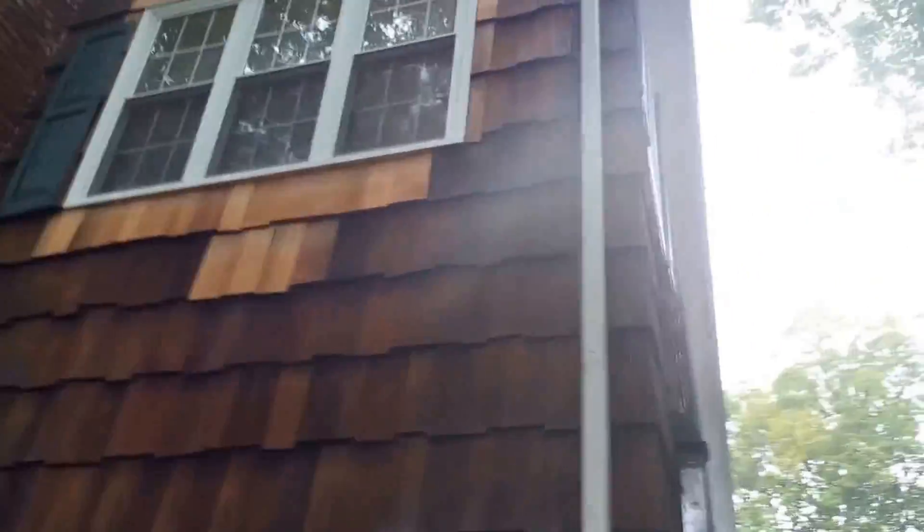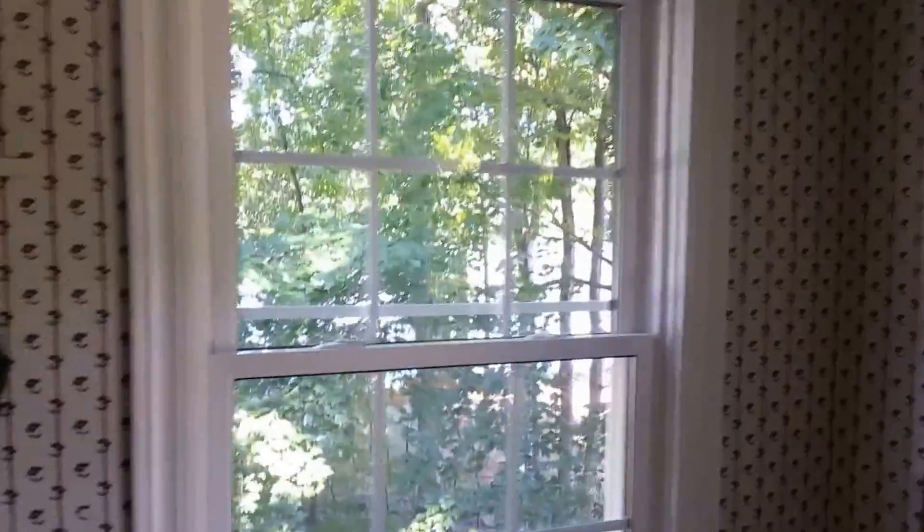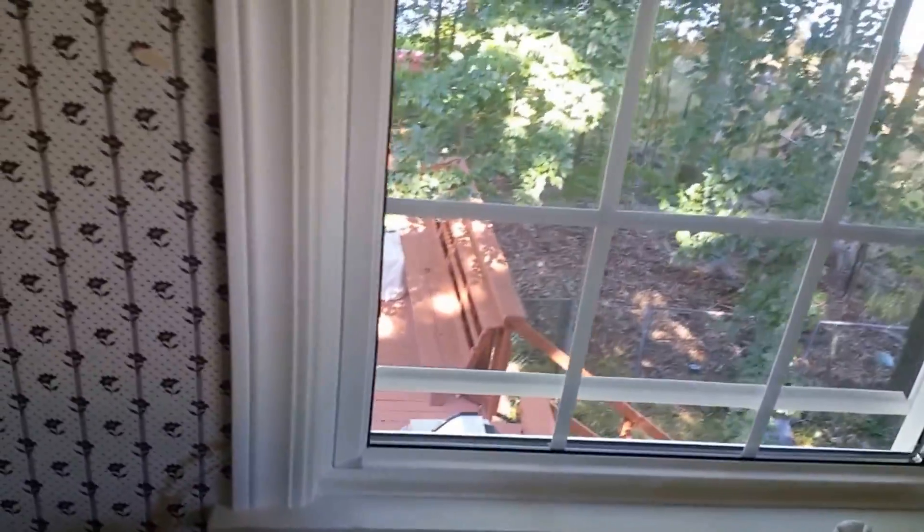That's about it — I'll show you the inside. We do these full-frame windows here on the Randolph/Denville border. I just want to show you how we get this factory pre-finished trim and put it over the window using glue and other techniques so there are no visible nails. Look at that beautiful pre-finished white — it's also available stained. Really beautiful molding made of maple, which is a harder, heavier wood.